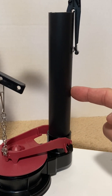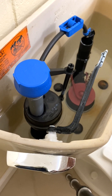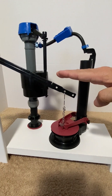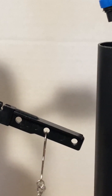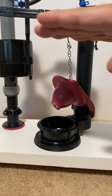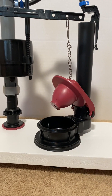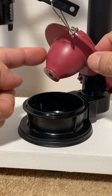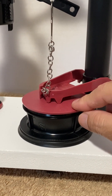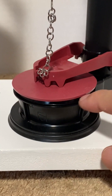And finally, the overflow pipe. Now let's look at how the flush valve works. Water sits in the tank waiting for the next flush. Pressing the handle down lifts the lever, which lifts the flapper. Now the water in the tank rushes out of the tank, through the valve, and down to the toilet bowl. Air in the flapper helps it float, and the flapper lowers as the water level drops, and eventually falls to close the valve. The flapper and the valve seat form a watertight seal.